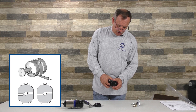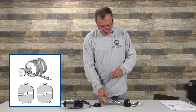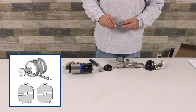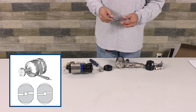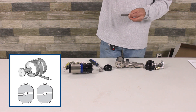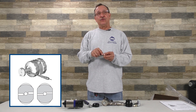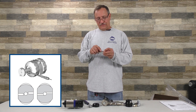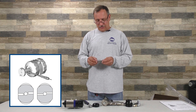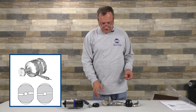Let me take this mixing chamber out and show you. This is your main point — you have an impingement point, which is a little hole on the side, and you've got a little hole on the other side. You can see through it — it looks like a half crescent sometimes. If you see a full moon, I wouldn't use it. Put the impingement drill bit they give you in — it should not go all the way through. If it goes all the way through, something's wrong: either the wrong drill bit or there's something wrong with the mixing chamber. Do not use it, because instead of a swirl pattern it's going to splash and you're going to have issues.